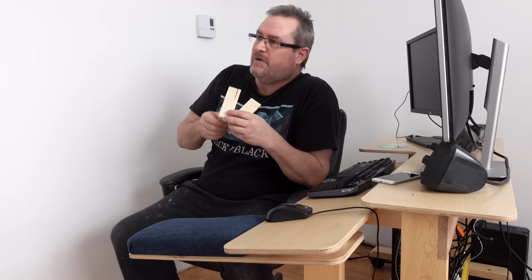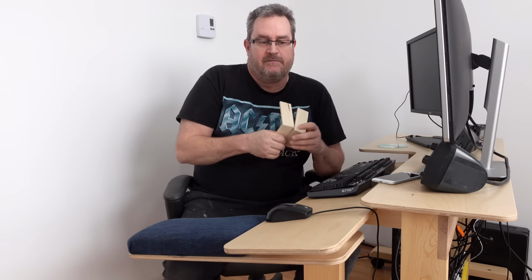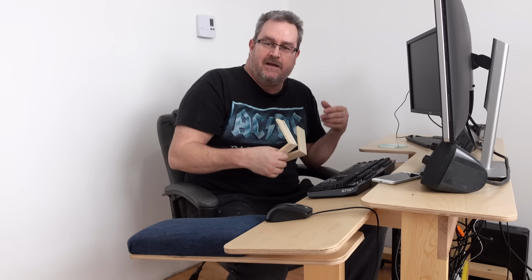That's the reason why, when they frame houses, they use nails. Nails are softer than screws. You can still use screws for certain things, but nails for the most part are used because they have that give, they have that yield. The structure can move slightly and your fasteners are not going to snap off and break and things will come crashing down on your head.